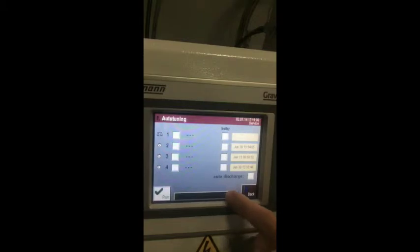If any specific component is selected as bulky, this allows for materials that are not free-flowing. If this feature is selected, enter the free fall limit value of 9999 grams. This high value can never be achieved, and the controller will automatically pulse any bulky-selected component.